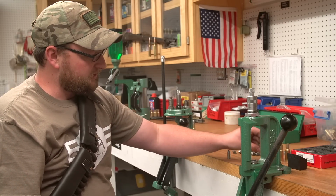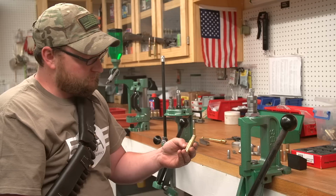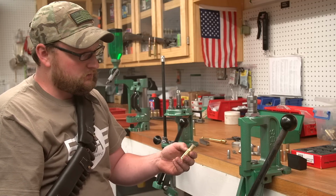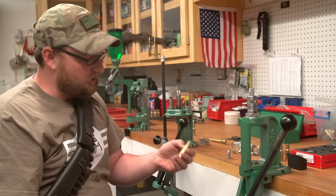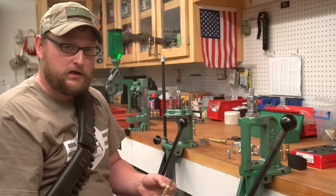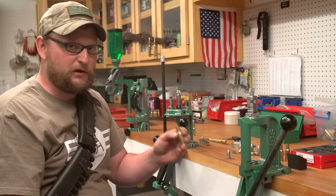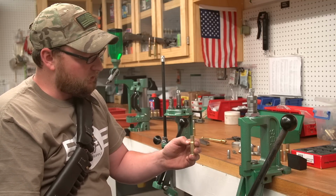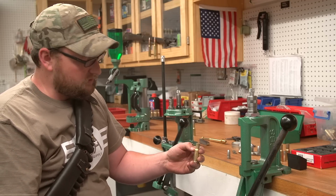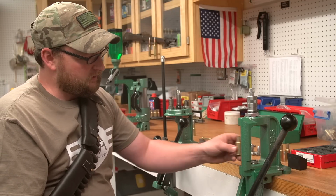We're going to finally start seating bullets and making a completed 577-450 Martini-Henry cartridge. So to recap, 24 gauge MagTech shotshell hull that's been trimmed to 2.9 inches. We've annealed it, run it through our die, did our final bump, made sure the shoulder was set back all the way. We primed them, went through and added 85 grains of black powder, which would replicate the original military loading. We added a tuft of Polyfil to take up a little bit of extra airspace that we got because of how thinly drawn this brass is compared to the original cartridge. We added a 30 thousandths inch thick cardboard disc, which is basically just a milk carton that's been sliced out. All right, a plug of wax, and then another carton piece, and then now we're going to seat our bullet.